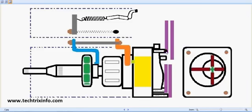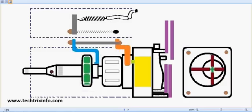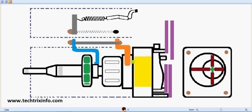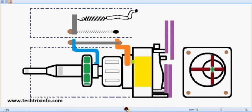So these are the two factors which help the fuel flow in the fuel injectors. It gets its drive from the drive shaft, resulting in the vane pump rotating, and the governor retainers move frontwards and backwards automatically according to the RPM of the engine, resulting in the governor arm moving, which thereby controls the metering valve and the galleries, which supply the fuel towards the injectors. That's automatically how the fuel demand is sensed. And when the accelerator is manually pushed, again the governor arm is controlled and the metering valve is controlled by the driver. That demand is also taken care of by this gallery, which supplies the fuel through the injectors.